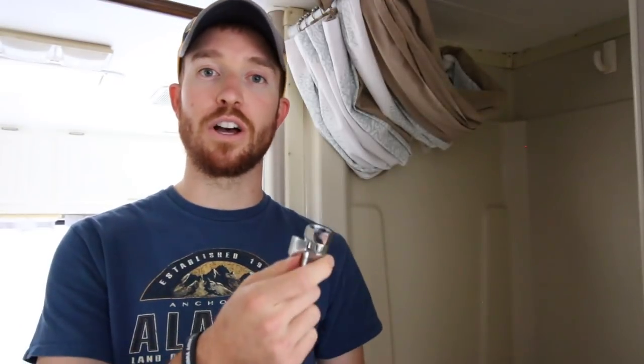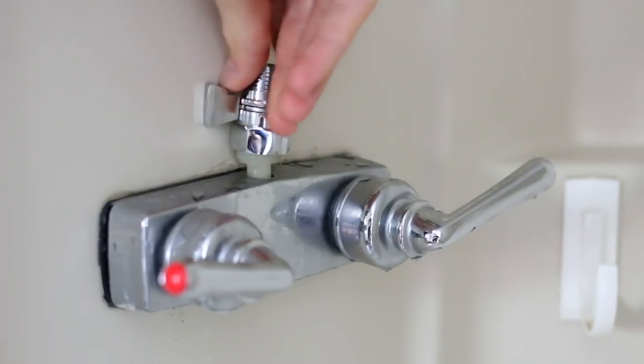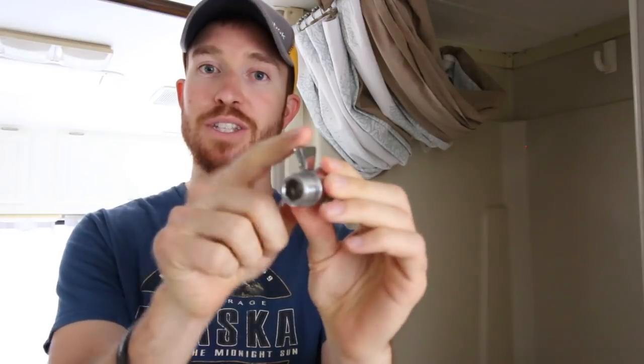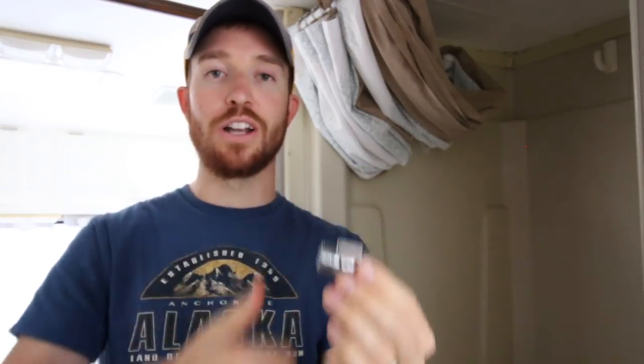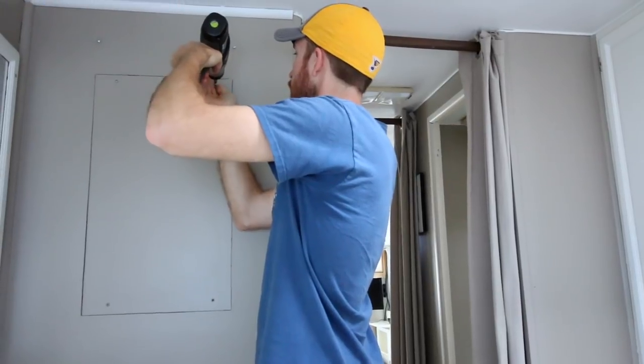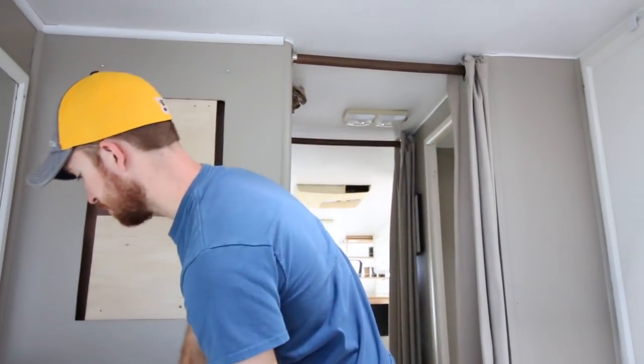To solve that problem, I bought this stopper valve. I'm going to install it on the shower faucet, but unfortunately there's not enough room between the faucet and the shower wall for the stopper lever to spin and twist. So I'm going to have to remove the shower faucet, attach this piece, fully screw it on, and then reattach that shower faucet to the wall. I've got an access panel cut out behind the shower so I can get back there, get the faucet removed, get this installed, and reattach the shower head.